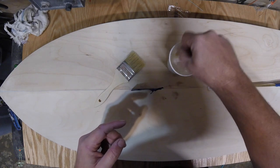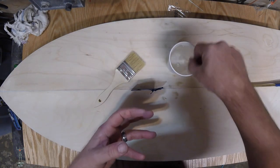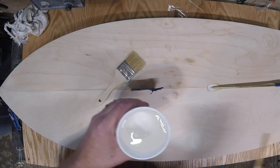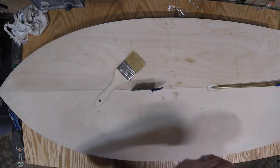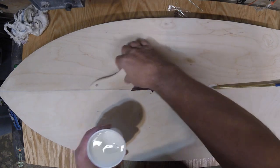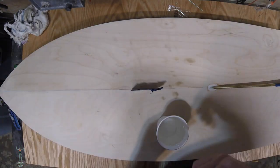All right, so we're just going to mix this up. I use clear coat because it's lighter, it's cheaper, it saturates the wood. It's super, super thin. It's thinner than West Systems. It works just as well, in my opinion. I seal all my boats this way, and I've never had one fail except for one, and that's because I messed up, and it was on our gas rigger that Joe pointed out to me this summer. I sent him a picture. He's like, that looks like you've got a little bit of water absorption in that wood. And sure enough, I had missed a spot when I did it. Fair play. You know, that was a long story, but something like this, very easy to do.